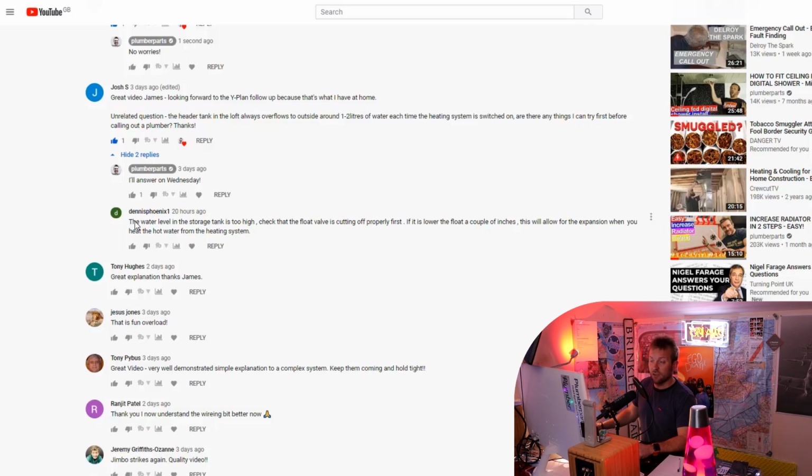Well done. I would also say there's a few other things you could probably do. Turn the temperature down on your boiler slightly and also turn the pump speed down slightly. Rebalance the heating system, see if that helps. Sometimes you'll find when the pump comes on, someone might have put the expansion on the flow side of the pump or something like that, and it's pushing water up there a bit. That's going into the tank in the loft, and then that's going out of the loft onto the floor, all over your patio that you've just cleaned. Try those things out, but also do Dennis's one first. That's probably going to be your first port of call.